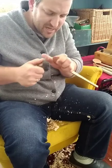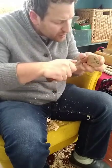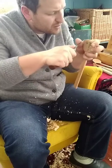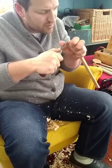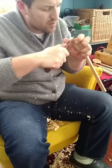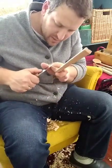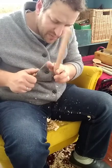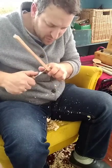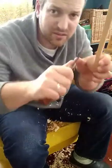I'm trying to do it in as few cuts as possible because every time you start and stop there's a little bump. Now I do the shoulder side — I just do the shoulder side second. I find it's easier to visualize what needs to happen with this one once the top of the bowl is done. In that neck, I'm using just the very tip of the blade and twisting it.